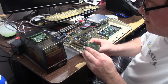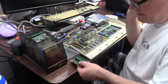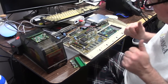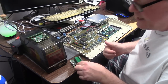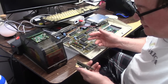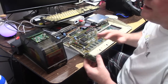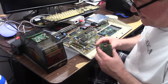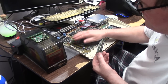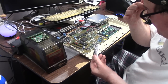I did not do the ROM. I did not do the ROM files. I did not do anything. I left the default config rolling. I used the wrong pins. I noob-leveled this thing perfectly, and I got through it. It was not scary. It's a little bit of Linux commands, but if you can read and you can right-click copy and right-click paste, the instructions are very clear on how to get a basic initial setup. So anything in the Amiga 500, 500 Plus, or the 2000 range, anybody that uses the big old 68000 socket.